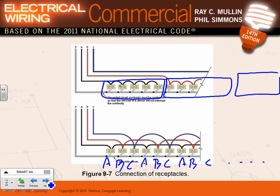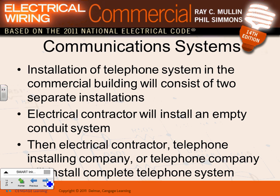That's exactly how we wire circuits — sharing a neutral between three phases and picking a receptacle between every phase and neutral. This applies whether it's a multi-outlet assembly, lights at the ceiling, or anything else. This is a multi-wire branch circuit, and it's very important because a lot of people get confused about it.